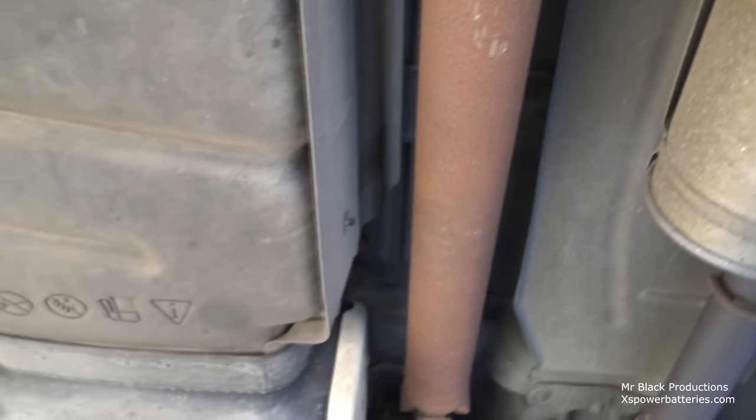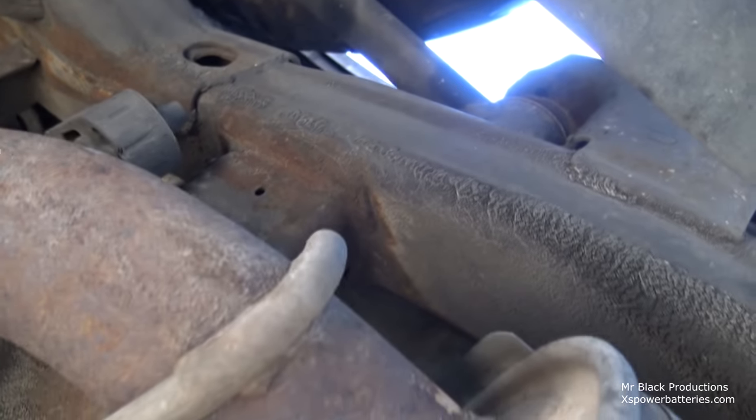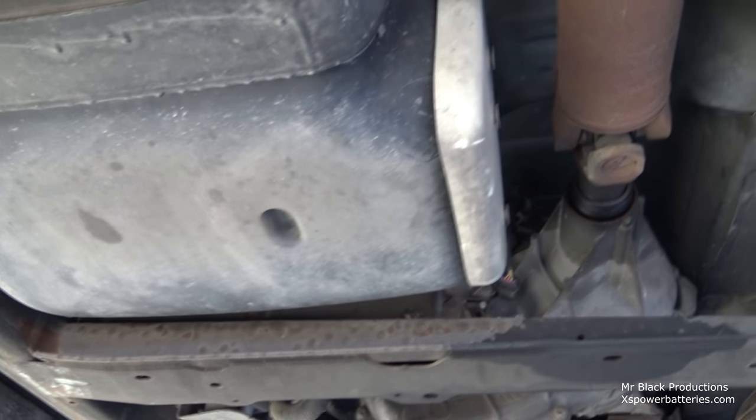Which I've got enough room to be able to get the wire snuck through here and then cross over on this cross member support here. And that'll allow me to sneak on the back side of the gas tank and make the turn into the cab. But it's cluttered underneath here, or it's by a bunch of stuff that's stupid hot that I definitely do not want to fool with. So I think we're gonna go up this side of the truck, up the middle. We're gonna tuck behind the heat shield, cross over the top of the fuel tank, and then back into the cab.